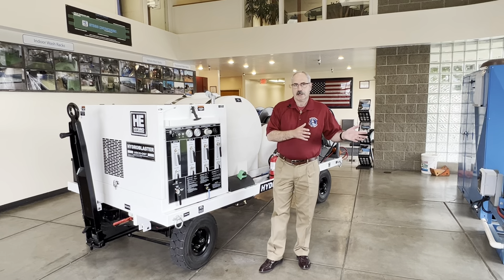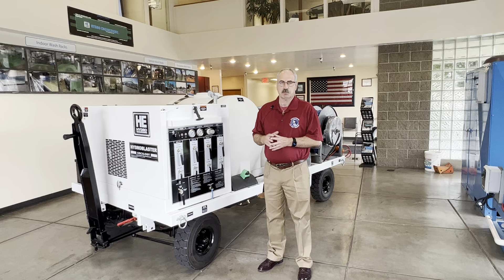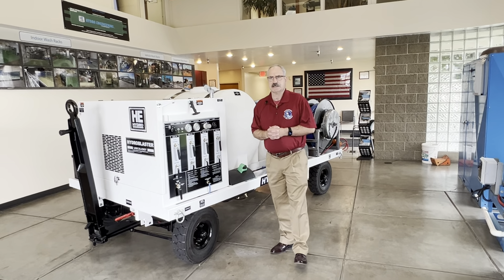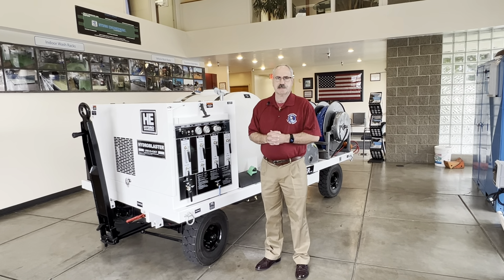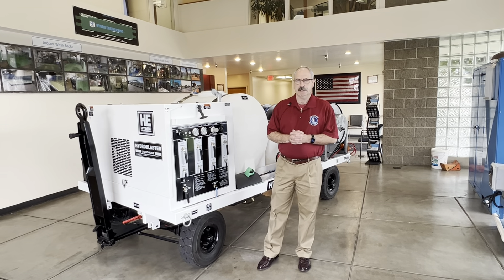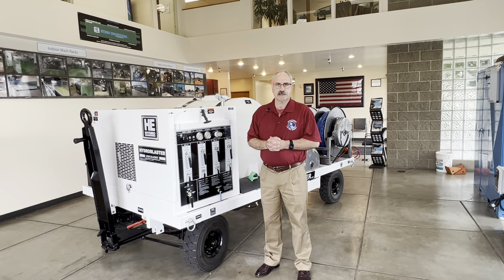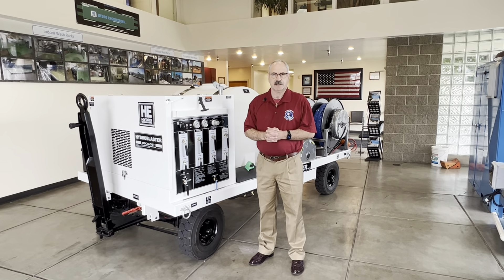We'll begin with the other aircraft, as the procedures for the C-130Js are more intricate. So let's discuss the other aircraft that this will also service. It'll service the CFM-56 aircraft, which is found on your KC-135 refuelers — on the civilian side, that's your 737-600/800 series. It'll also do the PW-2000, found on your Boeing 757s, also designated F-117 in military use, found on your C-17 Globemasters as well as the Pratt engines on a C-5 Galaxy.